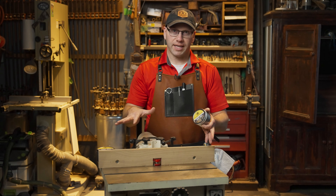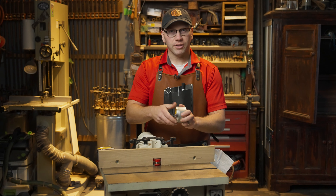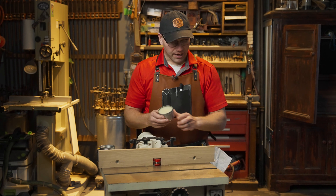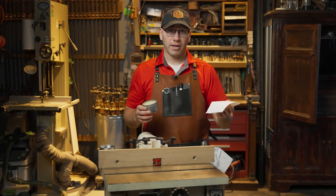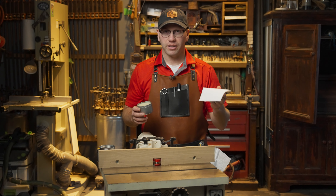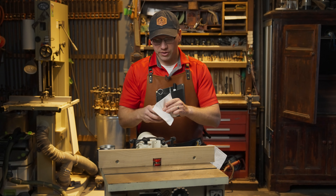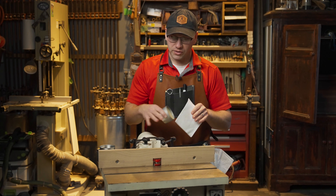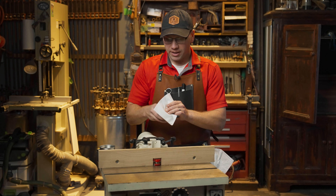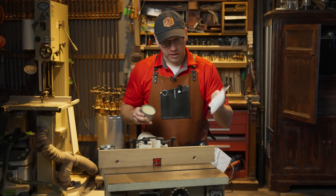So we're going to apply it to this metal top. Each one of these containers has a screw top, so you can just unscrew the lid on both of these containers. I like to use either one of our buffing pads, whether it's a 4x3 or even a 3 inch, or even a clean white rag — whatever you have laying around, it's just about universal. All you have to do is start with a clean surface. We just got done using this, so I just wiped away all the sawdust off of it, and just want to use a little bit of the wax on the pad.